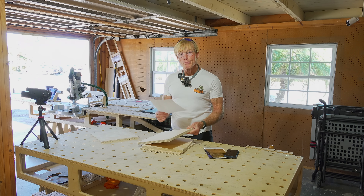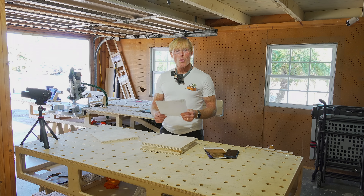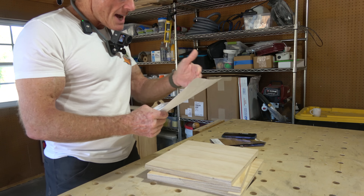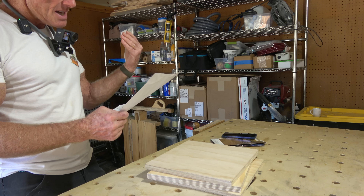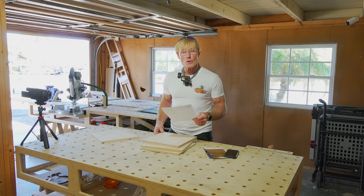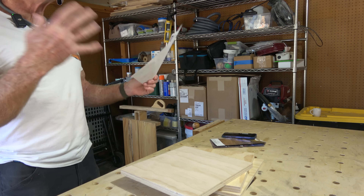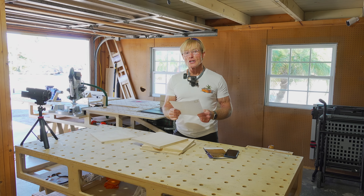AC face, 220 super sanded both sides — I could make cabinets and paint or even stain this. Calibrated to plus or minus 0.3 millimeters. BIFMA testing is commercial cabinet and office furniture testing, and this passed all tests for strength and stability: top load, leg strength, and more. Made from select hardwoods and softwoods from renewable grown sources with no tropical wood. As of the end of 2022, the 18mm is $162.14.